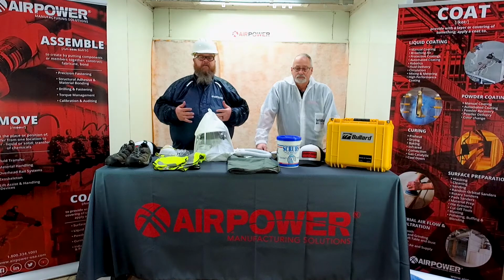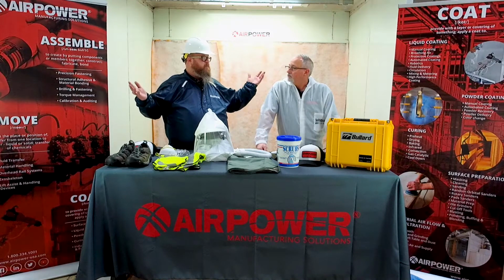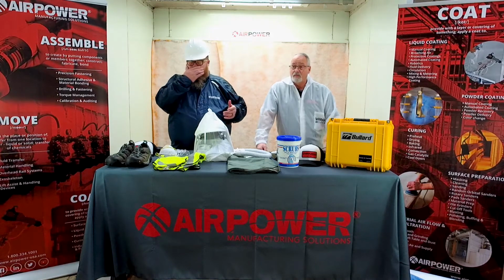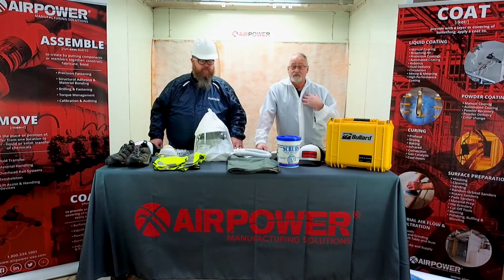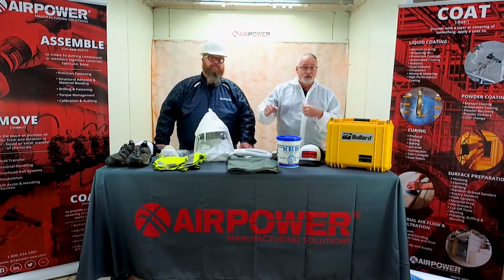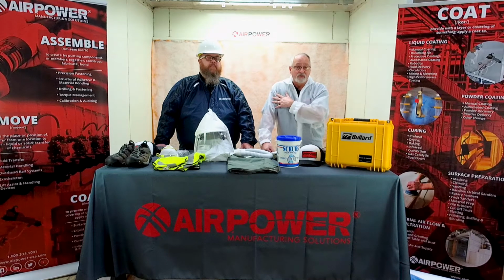But there are a lot of different clothing options. The simplest would be the Tyvek suits. They order them all the time. They don't breathe real well. They're very hot, but they stop liquids from penetrating. So if you're the guy on the line required to wash these parts with, say, a pressure washer, and you get splashback, then that's going to be different PPE for you than for somebody else, right? And if you get the coating on you, maybe the Tyvek is going to protect you better, so it doesn't get on your underclothing, stay on you, and maybe burn you after a period of time. But they're hot and they do lint a little bit.